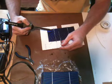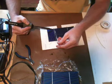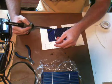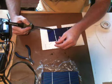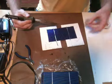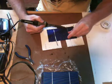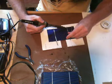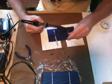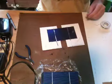Once you get the tabbing wires cut to about the right length, I usually go through and kind of heat up the solder on top to get it started. You also want to make sure these things are straightened out — they're pretty flexible, but if there's any big kinks in them you should get it out and get them kind of straightened before you put it all together.